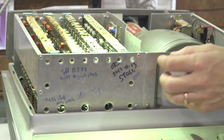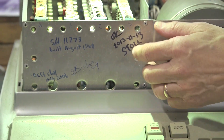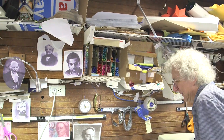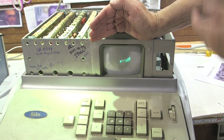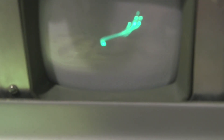I'm working on this. My problem is, in August of 2006 I got it working, and it was working in November of 2013. Today, it's sort of not working very well. I'm going in with an oscilloscope. Unfortunately, you can see it's dancing around. If we type a number in — I can see that two of the scanning boards are working, but I've got some troubles in the arithmetic board and the logic. I've got work to do.